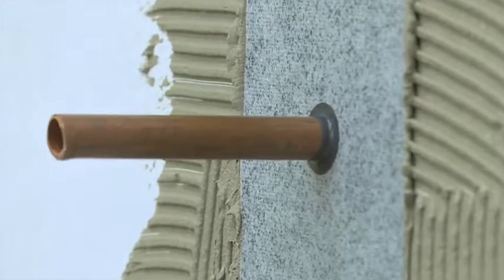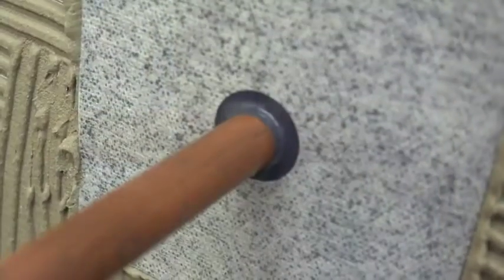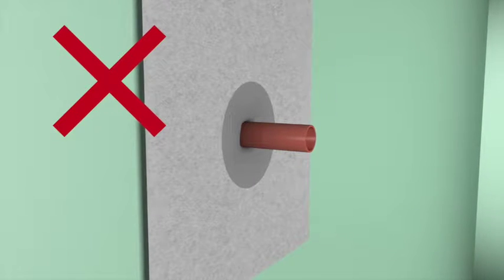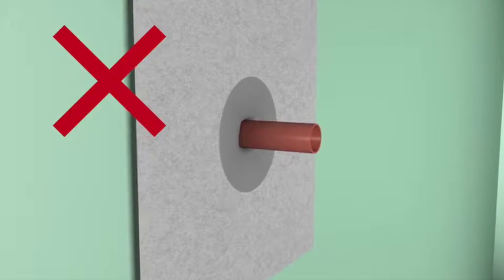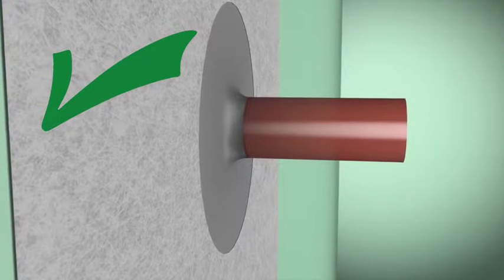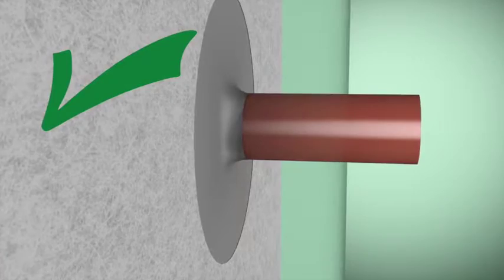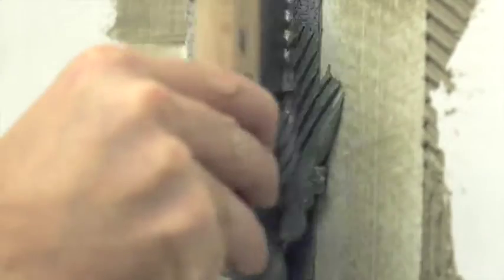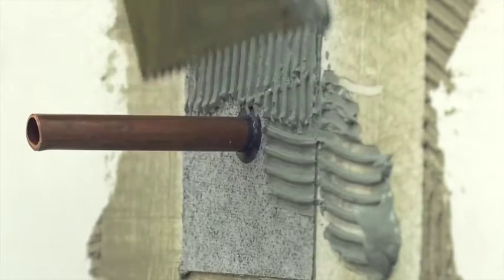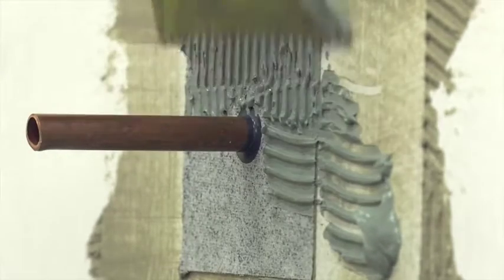The neck formed by the collar must extend outward along the pipe. Attempting to remove the collar could potentially damage it, so a tight seal cannot be guaranteed. A properly installed neck is shown here. Generously apply liquid sealant on the entirety of the collars. Extend past the end of the collars to guarantee that the seams are sealed.